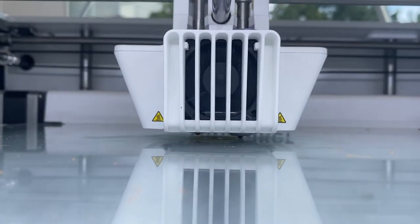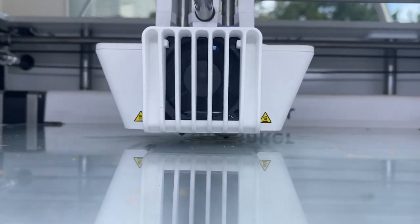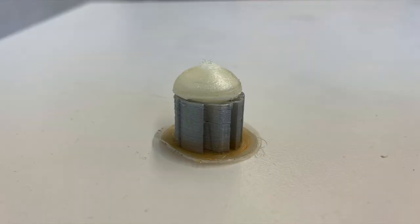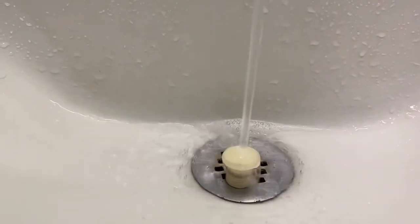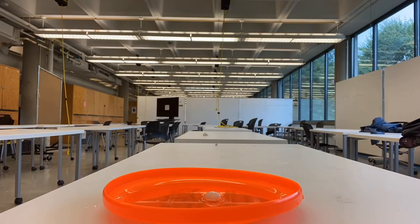Even when you've dried your filament properly before using it, you'll still want to keep an eye on your printing environment. You want a relatively low humidity level in your printing environment. I started off by 3D modeling the mushroom I was going to print and did a very small-scale test, which revealed two problems. Number one, the support material was quite extensive, so I modified my final model to not need any support material at all, which greatly decreased printing time. I also tested how water-soluble the PVA filament is, and it dissolves relatively fast, especially in warm water with a bit of stirring.